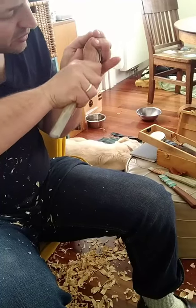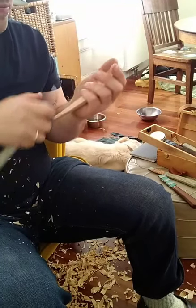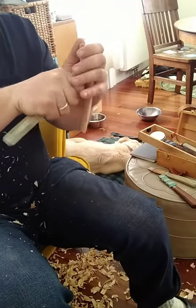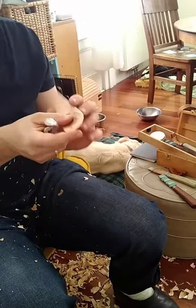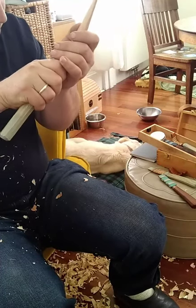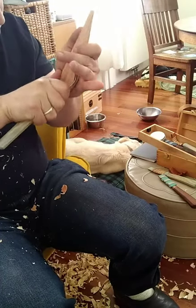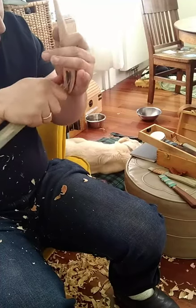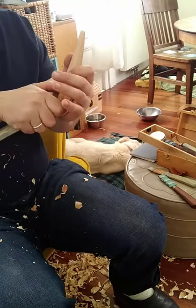Go down. Now remember, it's not that you have just one shot, but really, if you want to leave this form alone and do the bowl and be done, you've got one shot to get up to that line and not mess it up. So really work your way up to that line slowly and carefully and make sure that the depth of the bowl is progressing as well, so that you don't need to put more pressure on the whole spoon than you need to as you get deep into that.